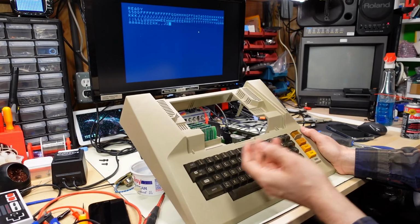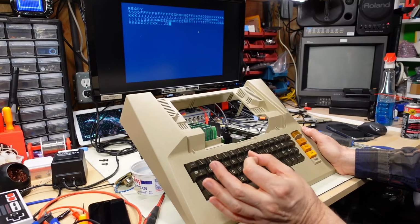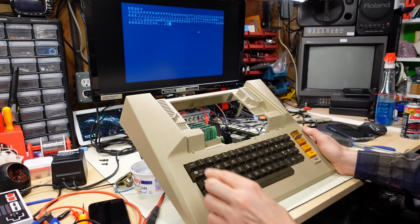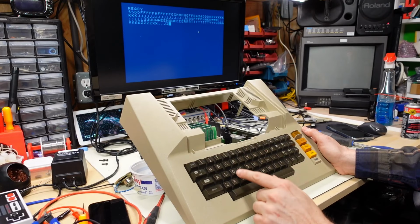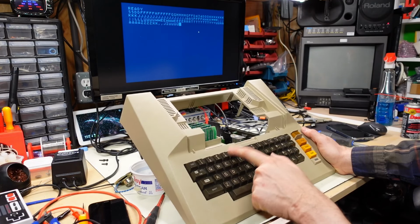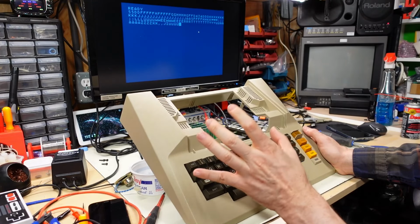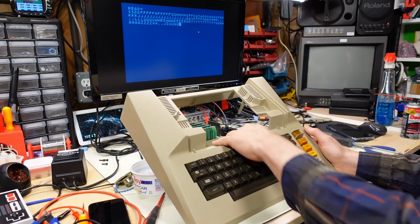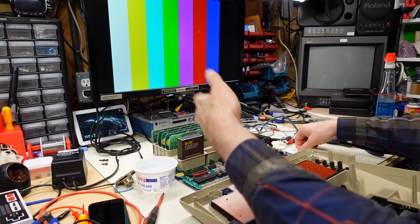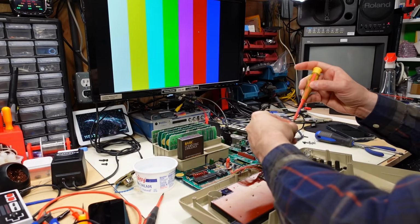My feeling is that probably the one spot where the little rubber thing pushes down onto the little divot is no longer working. And potentially when I push it with my finger, I'm pushing on a larger spot than the little point, the rubber point that are under the sliders. And that is why moving the board around makes it work a little bit, because it's now pushing on a spot that it wasn't pushed on before. Well, I'm gonna put back the rest of the screws and we will just see if anything is improved when they're all back in. Or maybe it'll go back to not working at all.